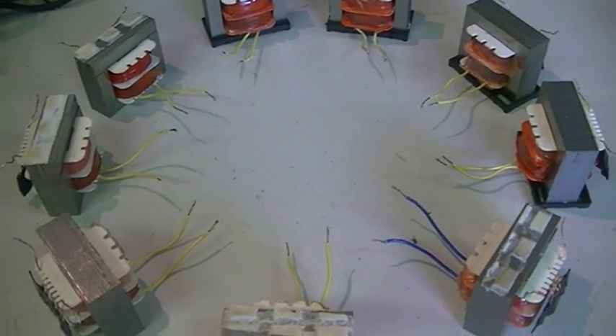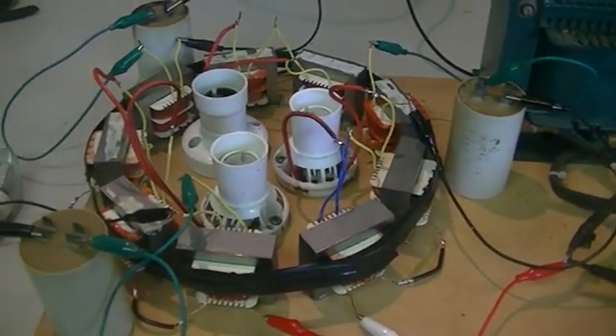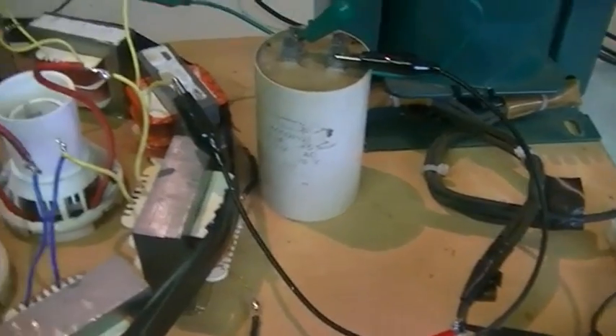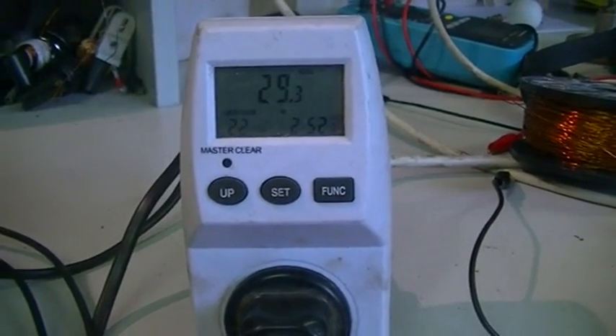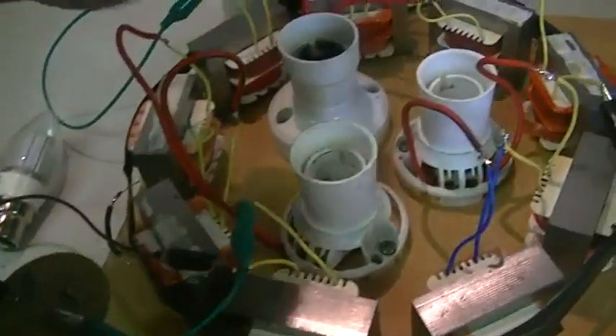We'll hunt out a transformer to do that job as well, and we'll be back once it's all mounted on the board. Here's where we're at at the moment — what started off as being an absolutely stupid, useless project has actually turned out to be something quite interesting. We've got all our transformers; every third one on the secondary side is hooked to these AC caps, 3uF each. There's our cap on our input, our 10 ohm, 10 watt resistor, and the blue channel is across the yellow channel which is across the transformer itself showing the voltage. Here's our wattmeter — our idle power is 29.1 watts. These are all hooked in series on the primaries.